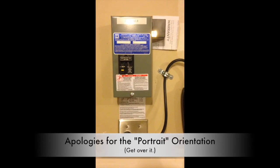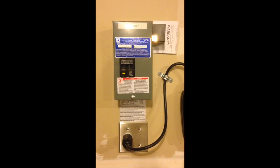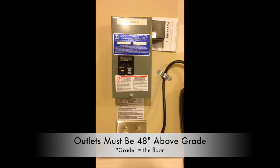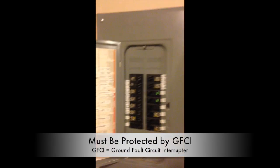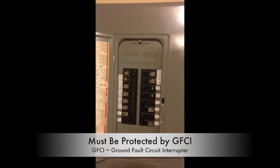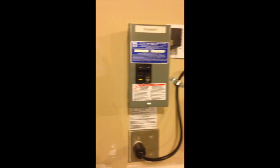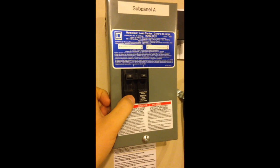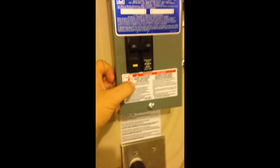Because this installation took place in a garage, my interpretation of any garage electrical wiring is that it must be 48 inches above grade and it must also be protected by a GFCI circuit. Since there was no room in our main panel for a GFCI breaker — a double pole breaker at 240 volts — we discovered that it was necessary to install a sub-panel where a GFCI breaker could be installed, so that if ever there was any sort of a short with the ground, it would automatically trip and the power would go out.